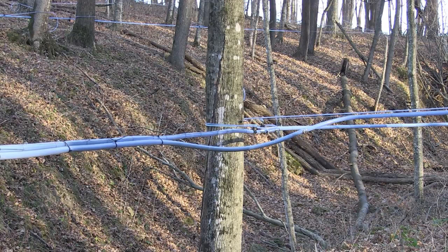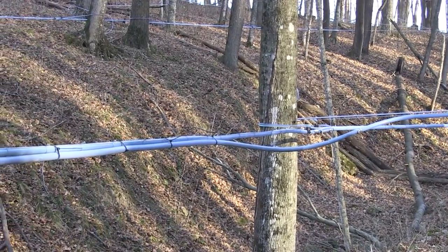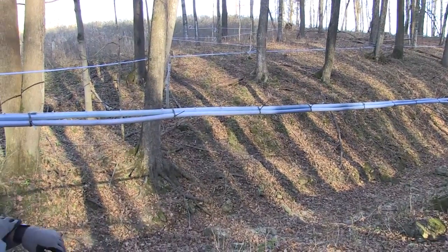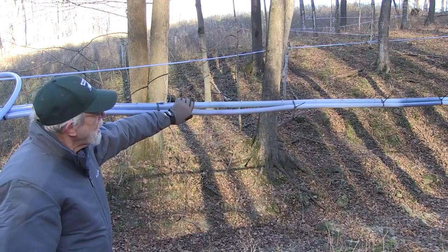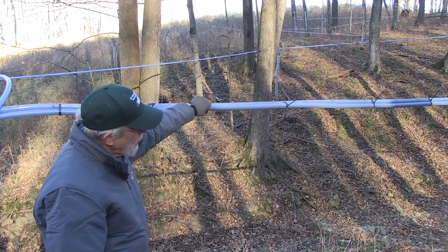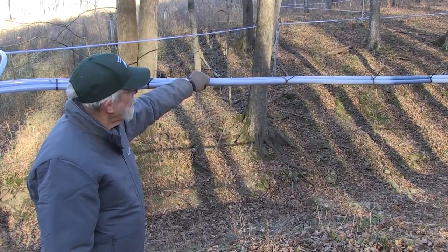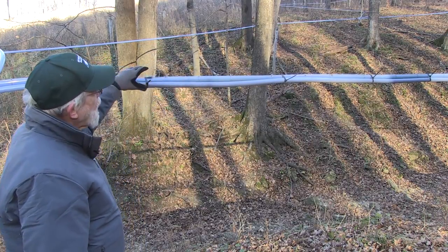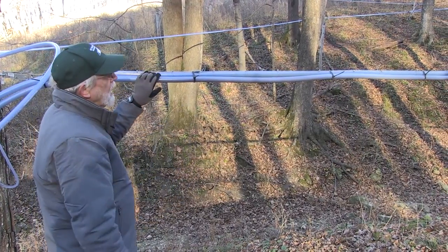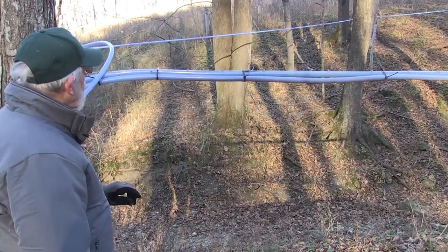If that pipe is full of water or sap, you will only get vacuum to the slug of sap that is in it. You want to ensure there's an even, downhill grade in all parts of the mainline system with as few sags as possible. That's a mixed blessing, because if you've got the line tight and snug during the cold part of the year, it will sag during the warmer season. If you put it out in the middle of summer with everything tight, there's a good chance that when things turn cold, the thermal expansion and contraction of the line will pull the unions apart. Those are things you need to think about as you're installing your lines.